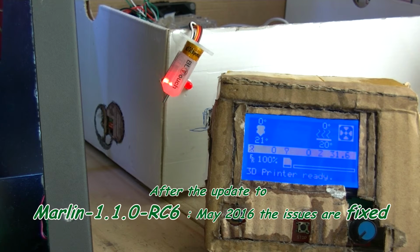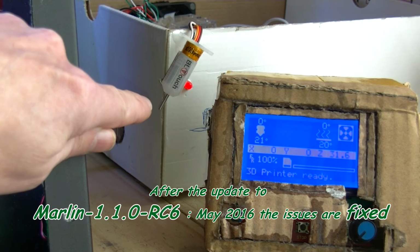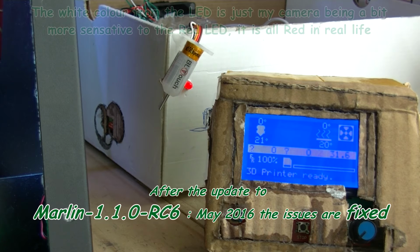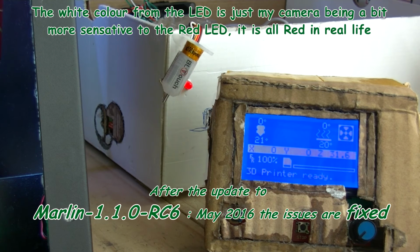Now I've already got it plugged in, and I've got Pronterface open. So I'm going to try some of the commands again, and this is the S10 command basically, M280 P0 S10, and that's supposed to bring the pin down. So send now, and see it's come down and the light's gone off. And if I change that S, I'm using Pronterface still, by the way, S90 should take it up. So it's gone up and it's made it light again.